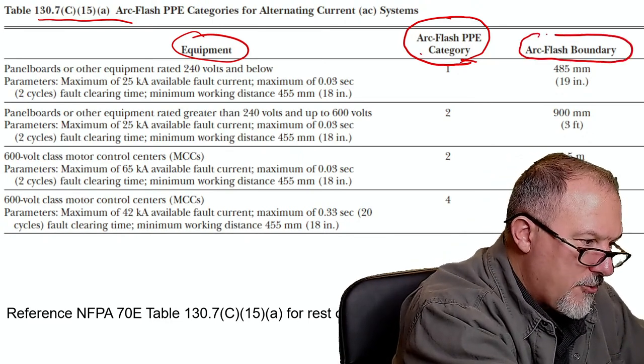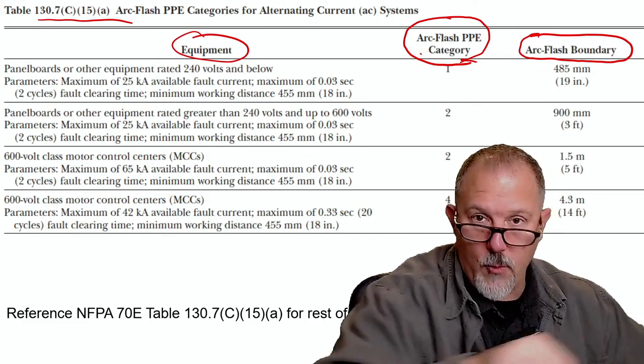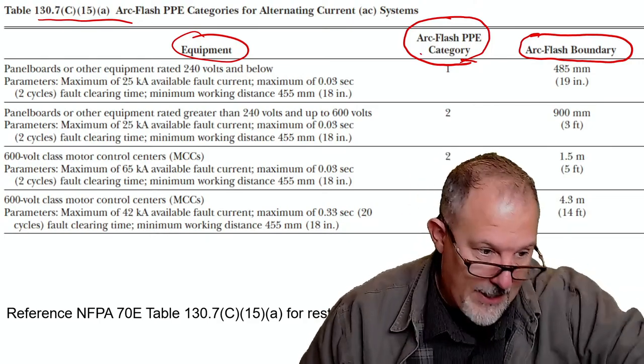We have the arc flash boundary. Remember, what is an arc flash boundary? If I'm doing a calculation for arc flash, say for my incident energy, I am going to calculate based upon distance how far away to get to 1.6 calories per centimeter squared. I believe it's 1.6, or is it 1.2? You know how we solve that one? We take the time to go back and look at the definition of arc flash boundary, 1.2. The arc flash boundary is, when an arc flash hazard exists, an approach limit from an arc source at which incident energy equals 1.2 calories per centimeter squared. Because what do we know? We know that the further we get back from the event, the less severe it is.